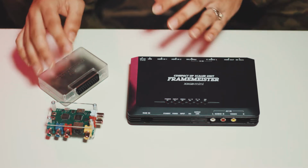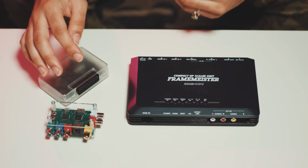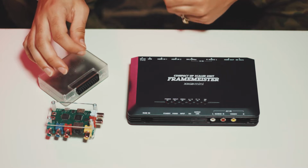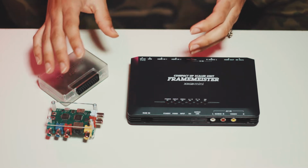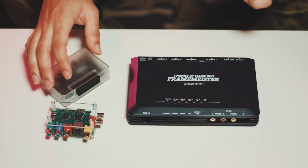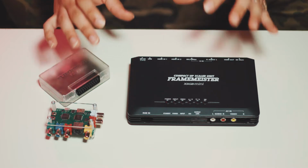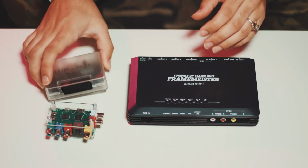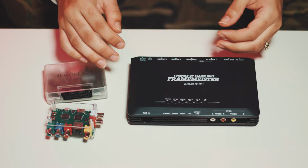The Retrotinks are simply line doublers, and much of my use case is for taking a 240p signal and bumping that up to 480p quality. It also helps deinterlace 480i video, and also some games utilize both 240p and 480i, and the transition can be delayed by your TV's native upscaler and even the Framemeister, sometimes taking several seconds to grab the signal again, whereas the Retrotinks don't have that issue. I'll exhibit this issue later on in the video.